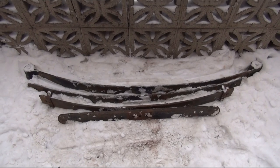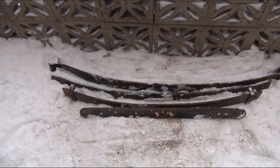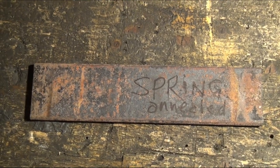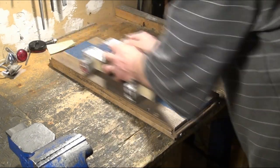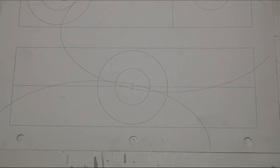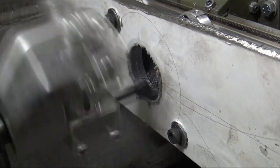So this year I used spring steel — solid carbon steel that can harden to the core. I cut it to rough size, heated it to orange, forged it flat and let it cool slowly to anneal it, softening it for easier shaping. I then sanded the surface, glued a pattern to it, and shaped the blade.